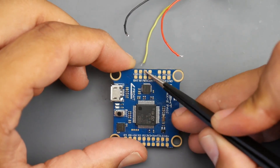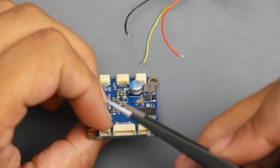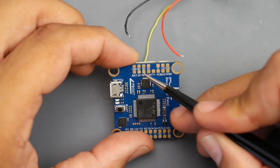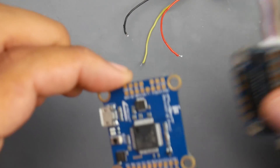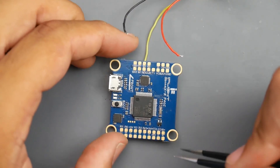After T1, we're left with all of these pads. We don't actually need to use any of them because the connector is doing all of that work. However, if you didn't have the same ESC, you'd want to utilize motor 1, 2, 3, 4, battery, and ground pads. I highly recommend you just buy the FC and ESC together — it's a lot cheaper.